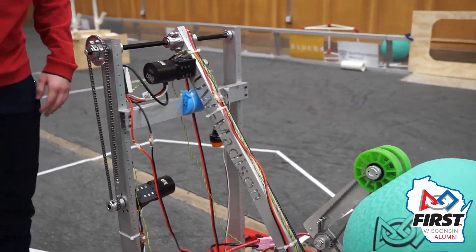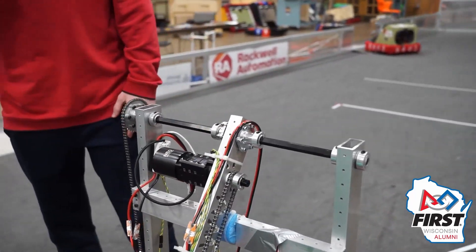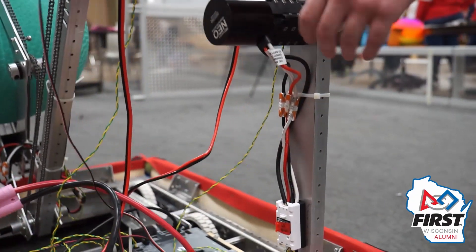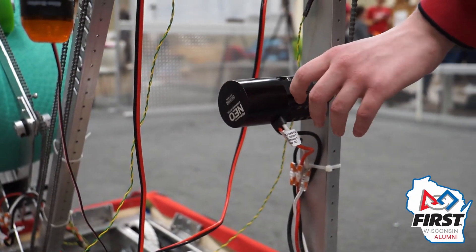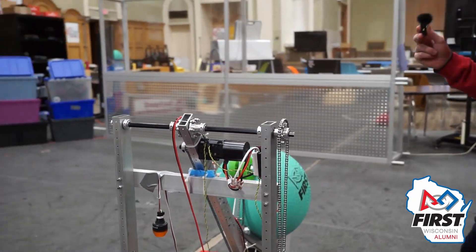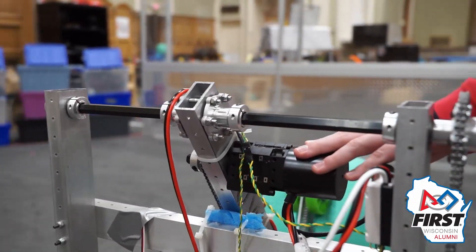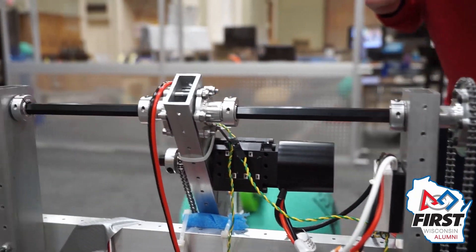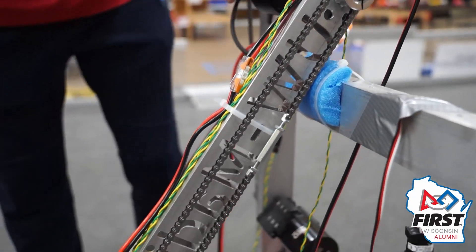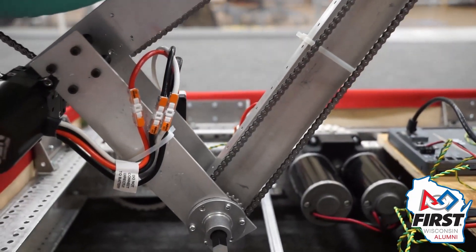For our gear ratios: for the arm, this is a 42-inch arm that is approximately 10 to 15 pounds. Our gear ratio running on this NEO right here is approximately 100 to 1 on the MAX Planetary and then about a 3 to 1 on the sprocket gear ratio. Then we have another for our wrist mechanism that goes down here with a chain, running at about 48 to 1 with the MAX Planetary and then about a 3 to 2 on the sprocket.